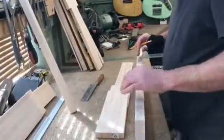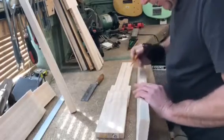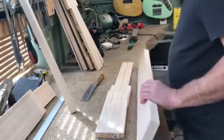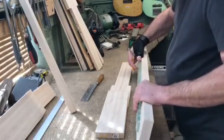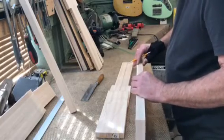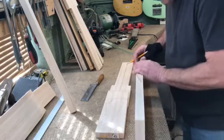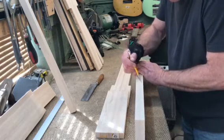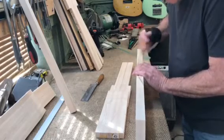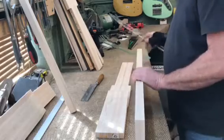And then we're going to take this, and then I'll take my jig. Now this wood's thicker than I normally use, but I'm going to mark the 2 spots that I want. Now the reason I'm doing that again is because it needs to be flat at the nut. So I'm going to put this here. And I'm just going to mark it here, but this is thicker than I normally do, but you'll see how it actually extends. And as I make it thinner, the scarf joint is going to move further up in the neck.